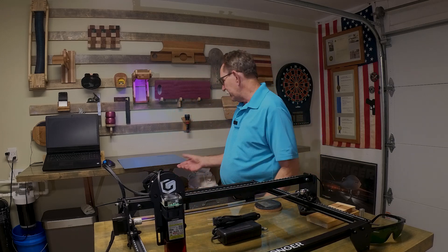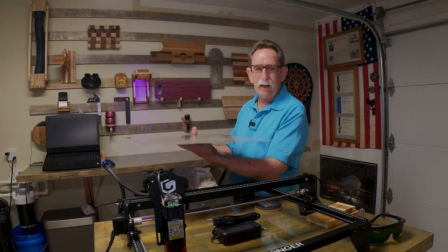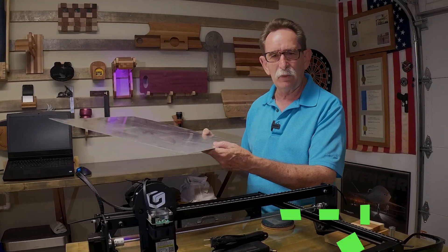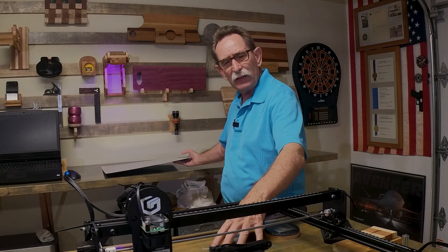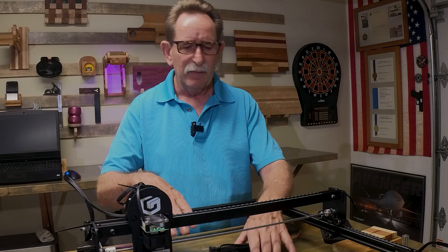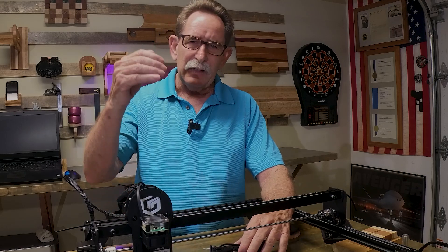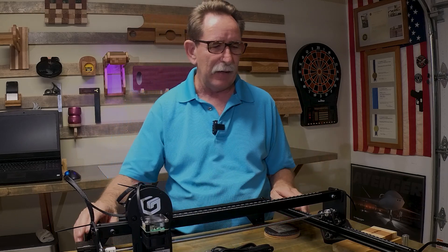I'm going to show — one of my followers was writing to me asking what do you put on the bottom of this? This is just a piece of sheet metal. It happened to come with one of the other lasers I reviewed along with a honeycomb table. You want to put something down on your table so that you don't burn it. They had suggested using clear glass, but a diode laser will go straight through the glass and could mar the tabletop, so you may want to consider that.